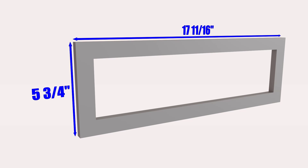The frame is five and three-quarter inches tall. The center is cut out, leaving a one-inch border all the way around. I'd suggest cutting the center of the frame out with a router, because you'll need to come back with the router to bevel or chamfer the inner edge. The reason you need to chamfer that inner edge is that the LEDs are recessed in the frame and that harsh 90-degree edge will cast a shadow and prevent light from reaching the edge of the marquee.